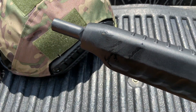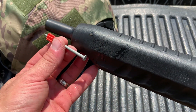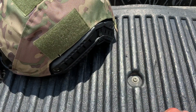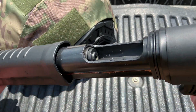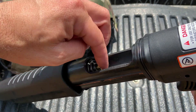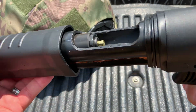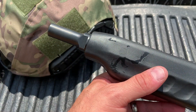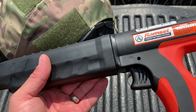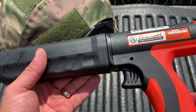If you're unfamiliar, this loads a unique nail that goes into the end of the gun itself, into the barrel. You want to do this when the powder charge is not there — you press it in and it sits flush. At that point you get a .22 blank, which you can buy. All of these items are available on Amazon. You close it up, and when the front is depressed it allows the striker to engage the back of the primer and fire.